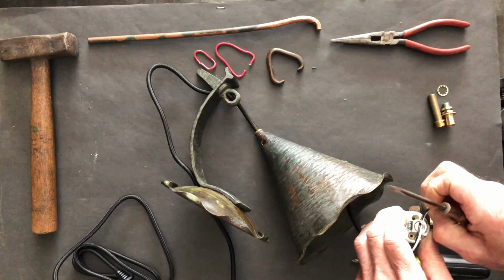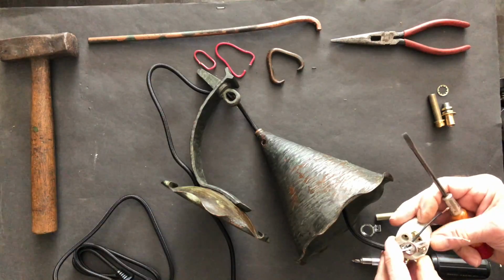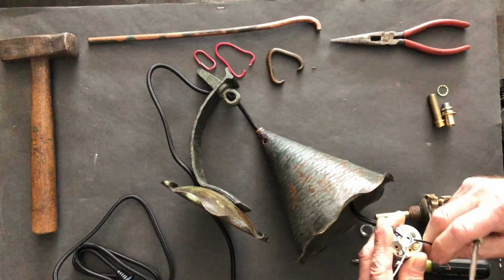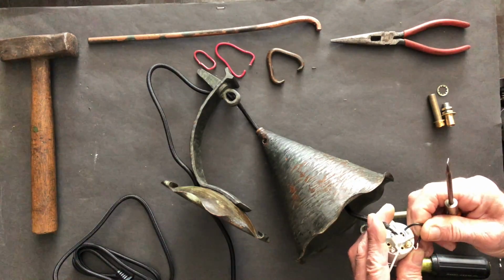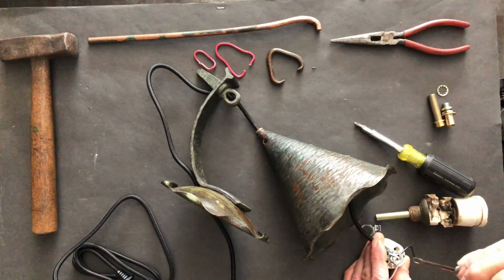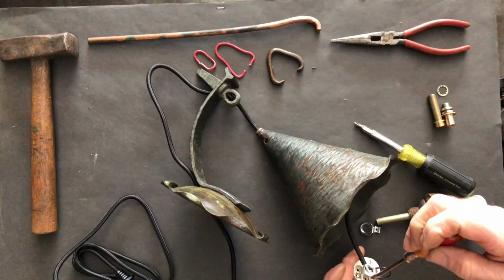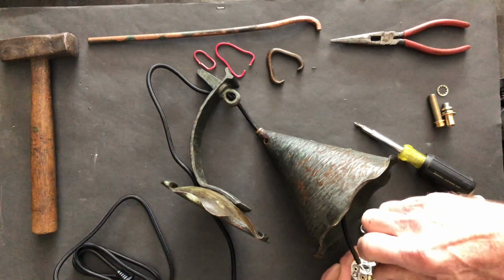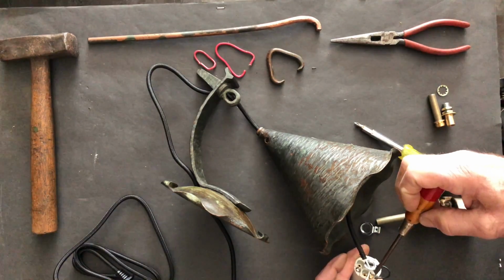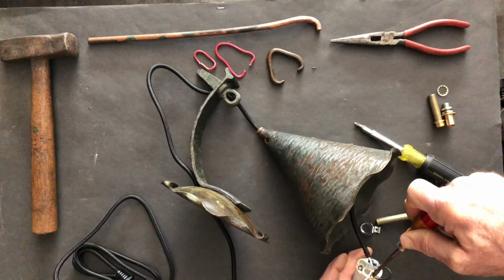Remember, we're going to want our active wire, the black wire, to be connected to gold, and we're going to have our silver wire, our white wire, connected to our silver screw. I want to make sure the loop is facing in the same direction as the screw is going to be rotating, because if it's looped over counterclockwise, it would tend to ride out of the position that we want it in. And as I tighten, that wire should snug up or climb in a little bit more. So you can see it's pulling the wire up underneath and snugging that into place.